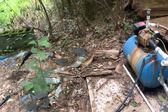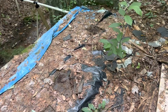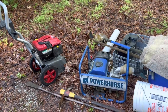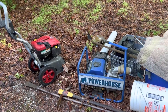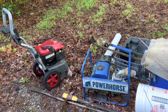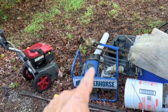As I'm hauling stuff down to the work site, first thing we're going to do is take all these tarps and plastic up and see what kind of surprise is underneath. With the spring work done yesterday, we're going to fill it in. Today we're going to open the lid on the tank, pump it out, and shovel out all the sediment — the owner doesn't know how many decades it's never been done. Then we'll pressure wash the whole inside of the tank, sanitize it, let it fill with the spring water, rinse it out, and pump it back down again.